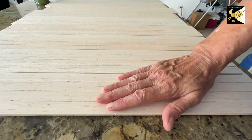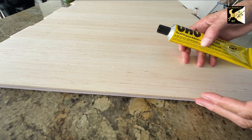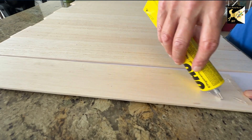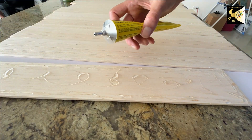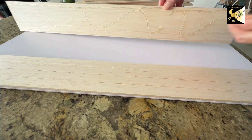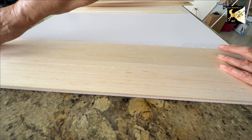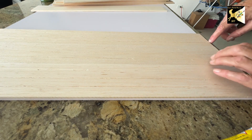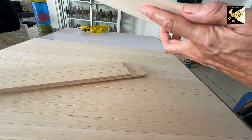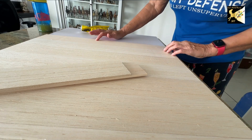I have nine panels and they fit perfectly from end to end and top to bottom. There are lots of glue types you can use — I'm using my usual UHU. Just put some around the edge and a little bit in the middle. You don't need to over-glue, but you should get the corners and edges quite well. As you go, butt them up next to each other and make sure they cover the whole board, keeping the bottom even. If you put the piece about an inch away and then push it in, you get even better glue coverage.